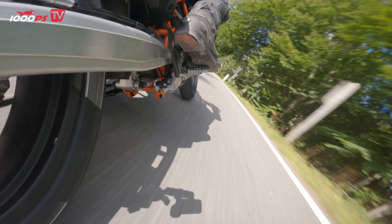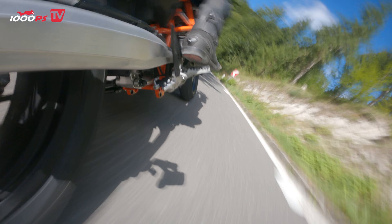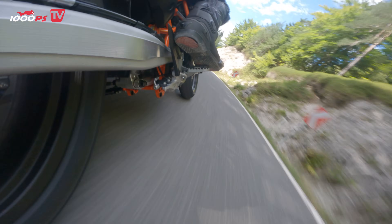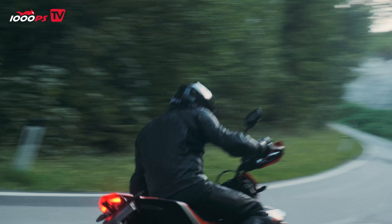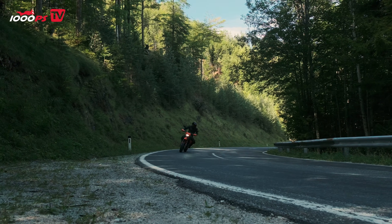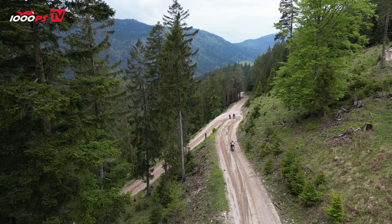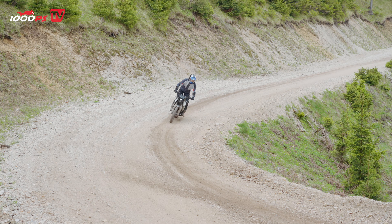When it comes to maximum performance, radial tires are clearly superior to diagonal ones. So why do diagonal tires even still exist? Diagonal tires are significantly stiffer in the sidewall area than radial tires — that can be a drawback, but in some situations it's actually an advantage. For instance, if you're riding off-road, dealing with big impacts, large stones, and deep ruts, you'll definitely want a certain amount of stiffness in that area, because tires with very soft sidewalls tend to bottom out easily. In off-road conditions you're not traveling at the same high speeds as on the road, so the increase in tire diameter at speed doesn't really matter. These tires are built more robustly and offer more lateral stability — even on some very heavy motorbikes this kind of construction can be beneficial.